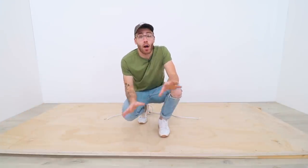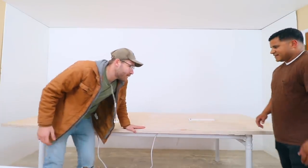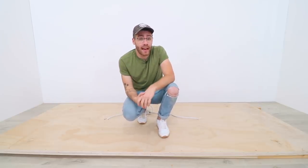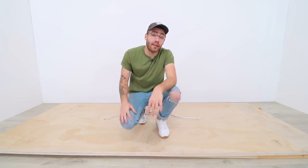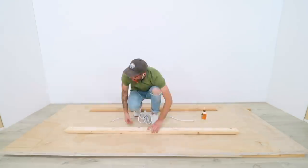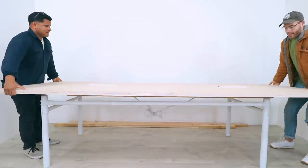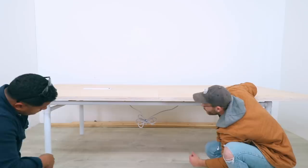Time to level with you — we tried to put the tabletop on the table base and unfortunately there was a little bit of sway. It was just too long of a span to stay rigid. Ideally I would have bought more connectors to create a center post in the base, but because I had to special order the connectors and didn't have time to get more shipped, I needed another solution. The simplest fix was to cut some 2x4s to length and attach them as rails on the underside of the tabletop. Even though this worked and added enough rigidity that there was no more sag, I still recommend using a center post instead.